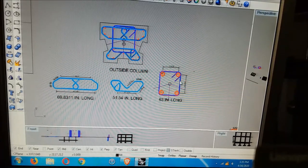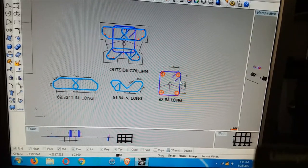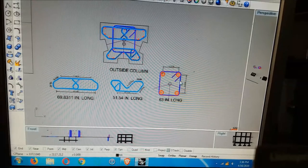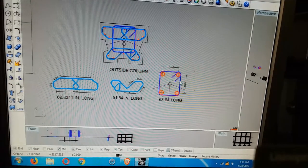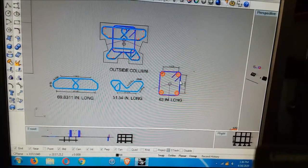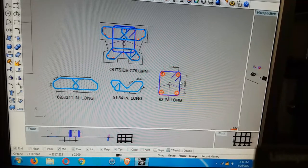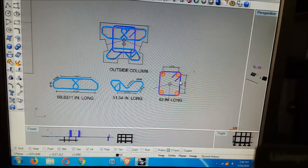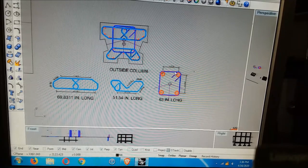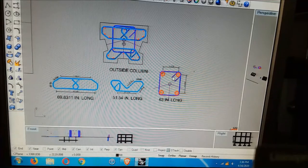When you read in your building codes, or the Philippine government's recommended procedures for RCCI, reinforced concrete with infill, the blocks of the infill structures, it deals with earthquake resistance and other things. By code, not just because it's a nice thing to do, this bar goes up and turns 90 degrees, but it turns another 45. So 90 and 45, that's 135.